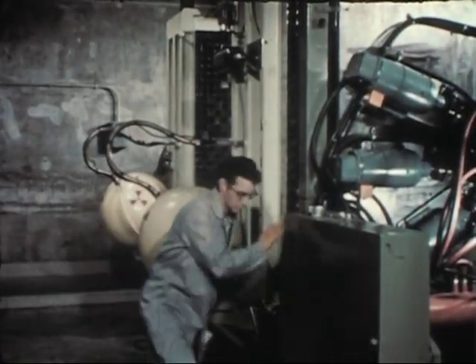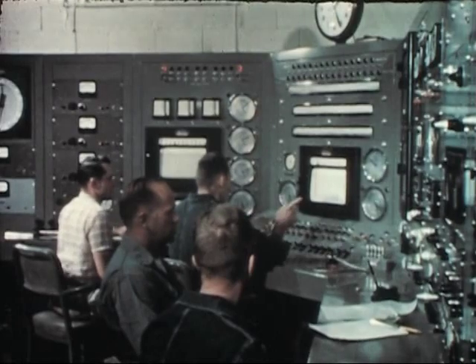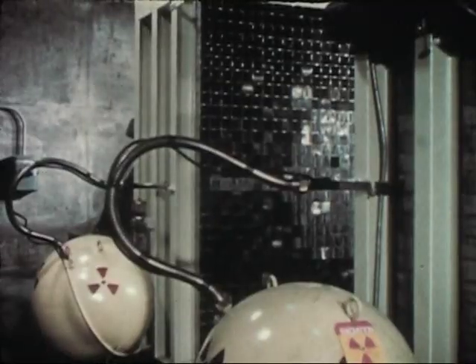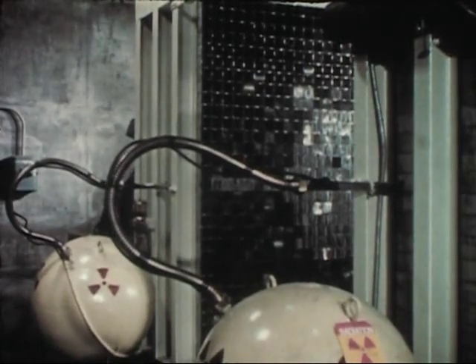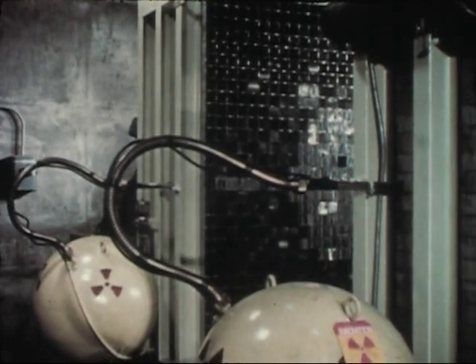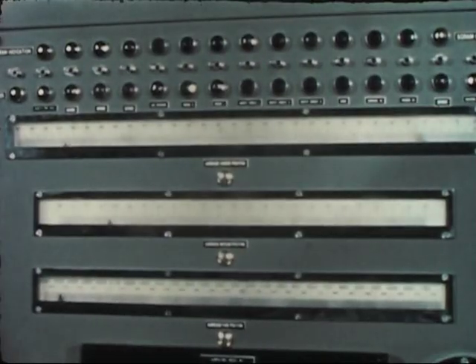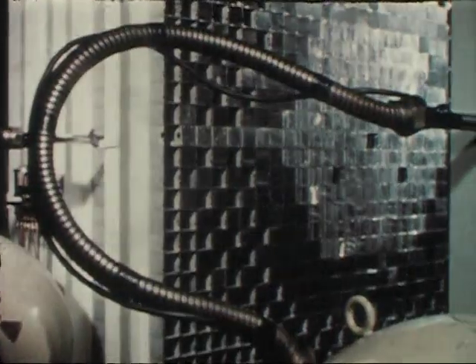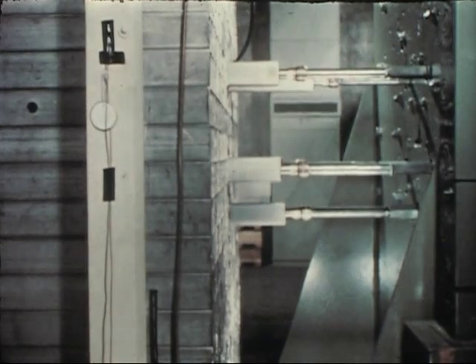Oilers and air pressure are checked, and the assembly room is cleared of personnel. The operator activates the scram interlocks, neutron source drive mechanisms, and begins to move the halves together. The reactor is assembled at a rate of 30 inches per minute until the separation is 18 inches. At the same time, four safety rods in each half are inserted. These eight rods must be fully inserted before the separation can become less than 18 inches.